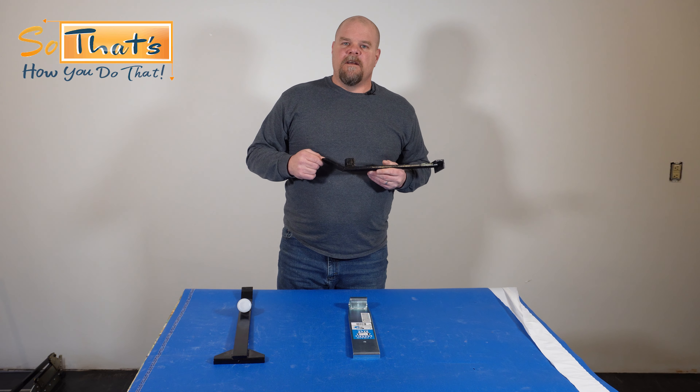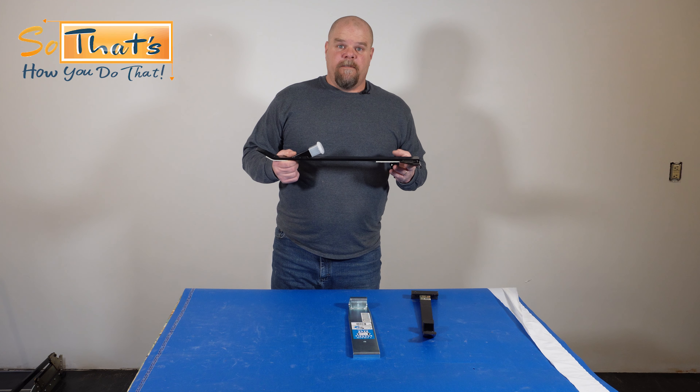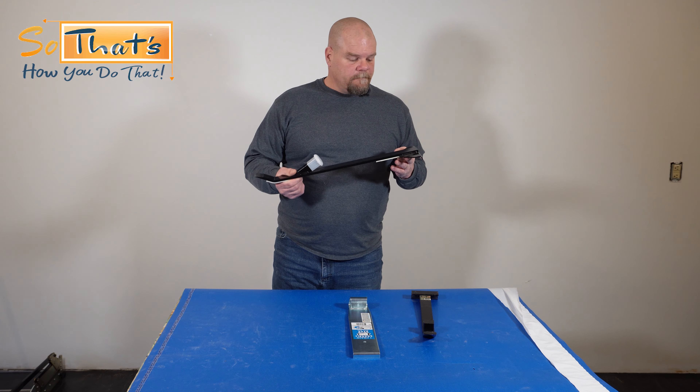It's too hard to get in there — you need to lift it up a little bit to lock in, but you really can't. Using a pull bar is the way to get into those tight areas. There are also situations where you get a few rows in and there's a gap in the floor that you missed — this is where the pull bar comes in. You can hit it and close those gaps up. So the pull bar is something you don't want to cheap out on.